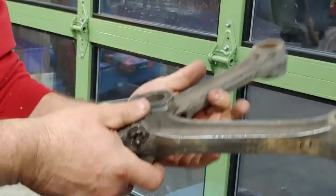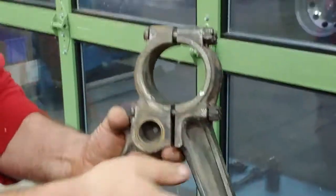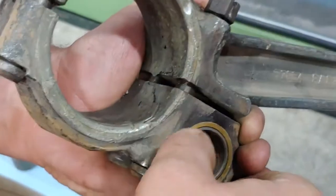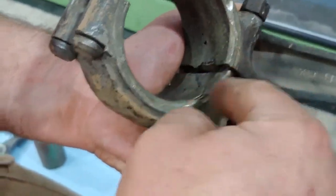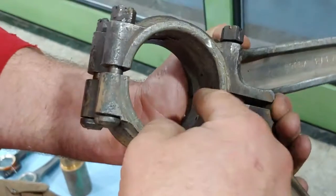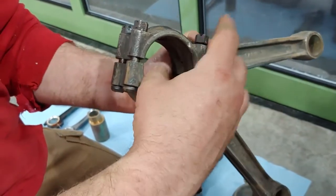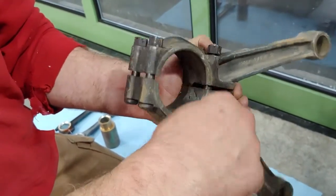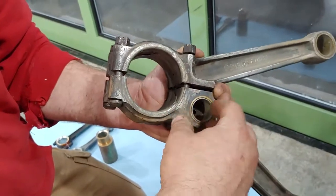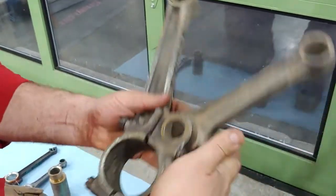Here's what one looks like all together — really pretty cool. And it's amazing how they split on the sides. The reason I brought this rod over here was for the ABM folks. The Babbitt material — you can see where this is delaminated, and you can see a small counterbore in here, Britt, for the radius to roll around. This is the lead-based Babbitt material from back then — it isn't anymore. That'll be taken out of here and then we'll pour in new number two Babbitt and get a molecular bond between these two surfaces. We won't ever have to worry about this taking place again unless there was some sort of catastrophic loss of lubrication. So it's a very complex little system right here — extremely heavy duty and robust.